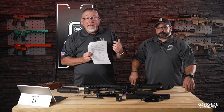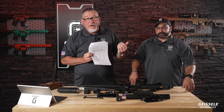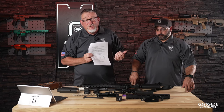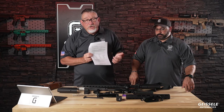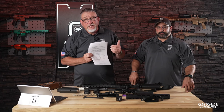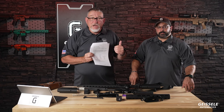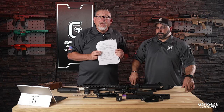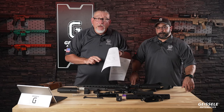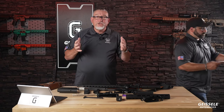And sulfur is a blessing and a curse. Back in the day, steel makers did not know how to remove sulfur, and there was excessive sulfur in some steels. Notably, a historical fact is the steel in the Titanic hull plates had excessive amounts of sulfur in it. But it also makes steel easy to machine. And if you look at the drawing for an M1 Garand receiver, that is made from 8620 resulfurized.